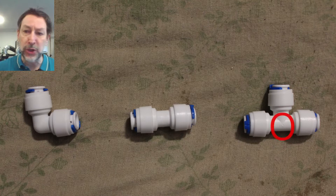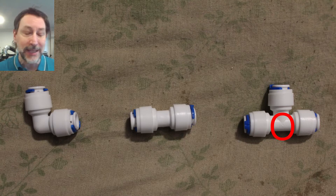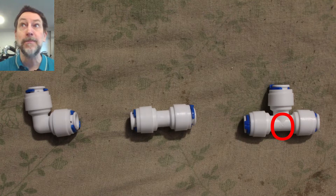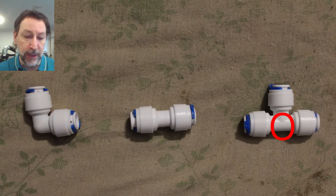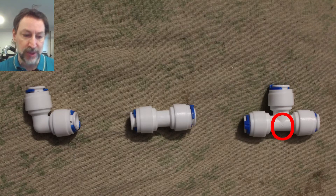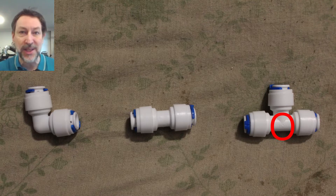This is number-two plastic — you'll see on the right side the T is HDPE, high-density polyethylene, and it's made for drinking water. I would suggest that if you're going to be away for more than a week you flush all the lines out to get fresh water in them again, but generally this is safe as long as the water is not standing still in the pipes.